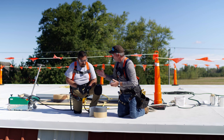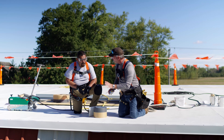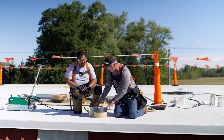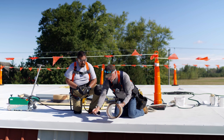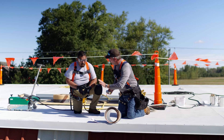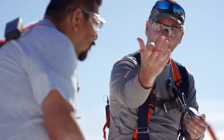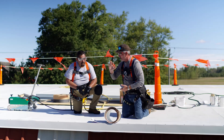You've got to have a good eye. We got pretty lucky in this building — it's pretty straight — but you've got to keep this nice and straight. Once I get the six and a half inches marked, I'm going to set the roll on it and hit my tick mark. I'm going to have you put the robot on it. Before you weld it, I'm going to roll it out to my next tick mark, pull it tight, and as you weld and get closer to me I'm going to move down to the next tick mark until we finish out this roll. That will be nice and straight.